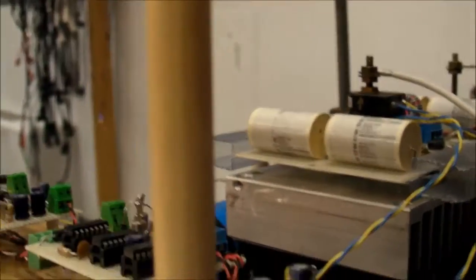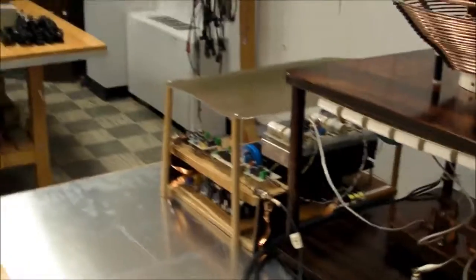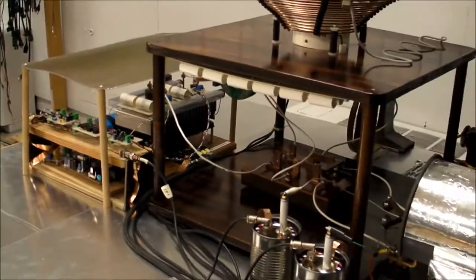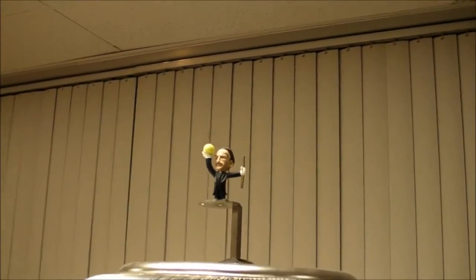I can also measure the voltage on the output of the IGBT bridge, and I'm going to have lots of data over the next couple of weeks — data I can use to analyze the difference between the solid state Tesla coil driver and the classical spark gap Tesla coil driver: which one is more efficient, which one gives louder or quieter sparks, which one gives a greater spark length per unit input power. I'll be measuring power with the old school analog watt meter here — I did have a digital watt meter but the high frequency noise was just too much for it. I'm going to call it quits for tonight now because both me and Mr. Tesla up here are getting high on all the ozone gas coming from the spark discharge. See you next time!